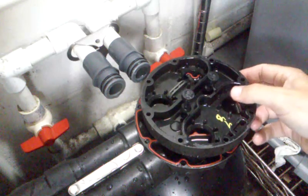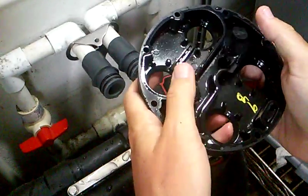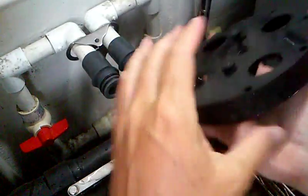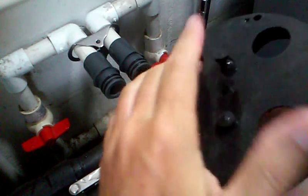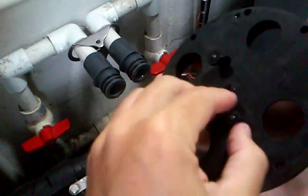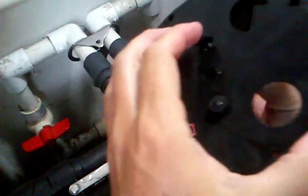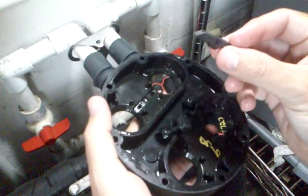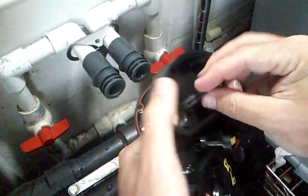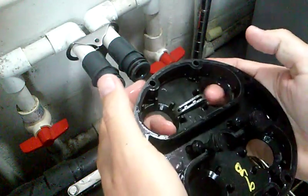That was levels two and three. Now this is level five. These are your drain flow controls — same deal, they have these seals and you want to make sure you get a nice seal here. I replaced these as well. Any rubber in your system is going to tend to swell up, so just make sure it seals correctly. This is one of the few movable parts in your system — it controls opening and closing one of these main valves.